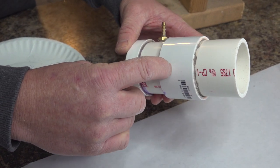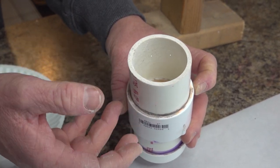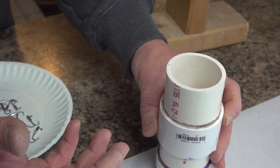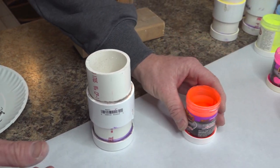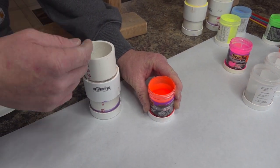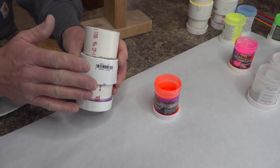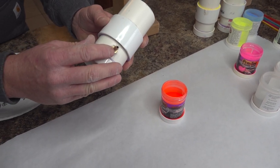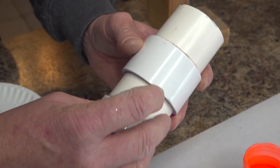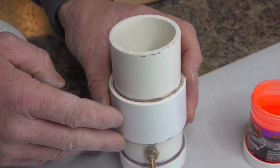So basically you have an air chamber here, your paper bag, and then you fill this full of powder coat and it'll bubble it. It'll fluff it right up like water almost. You can take a jig head and dip it in here, but it's more dense like this. You'll see in the video where it fluffs it up. Like I said, there are other videos out there that go more in depth on how to build these. Then I just used a hose barb here. All I did was cut a smaller diameter hole and tighten it up inside there with a little bit of pipe thread.